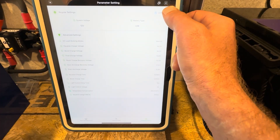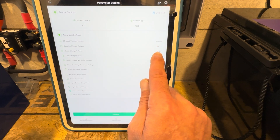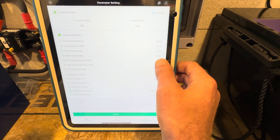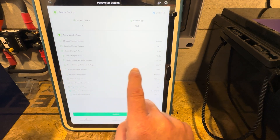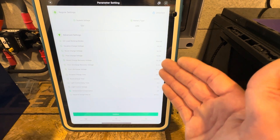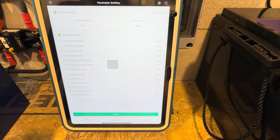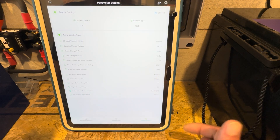Let me demonstrate the problem. I'll unlock the settings — everything is unlocked so I can change my settings now. I want to change my boost recovery voltage to 13.3 — confirm. I want the equalized charge time off — confirm. I want temperature compensation off and equalized charge interval zero days. I can work with this, so I want to save it — hit confirm. Now watch the values... Right back to 12.8, equalized time back to 120 minutes, temperature compensation back on. The settings did not save.